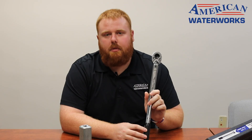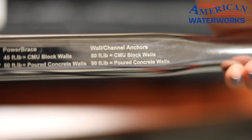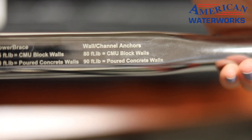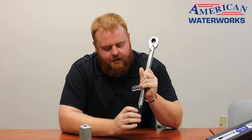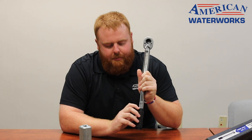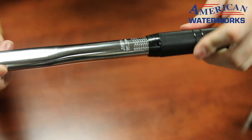For your typical block wall with anchors we're going to set the torque wrench to 80 foot pounds. Along each of these there is a little squiggle line that runs to the center. Basically what we're going to do is align the zero and the top of this handle up to the bottom of that squiggle line and right in the center.